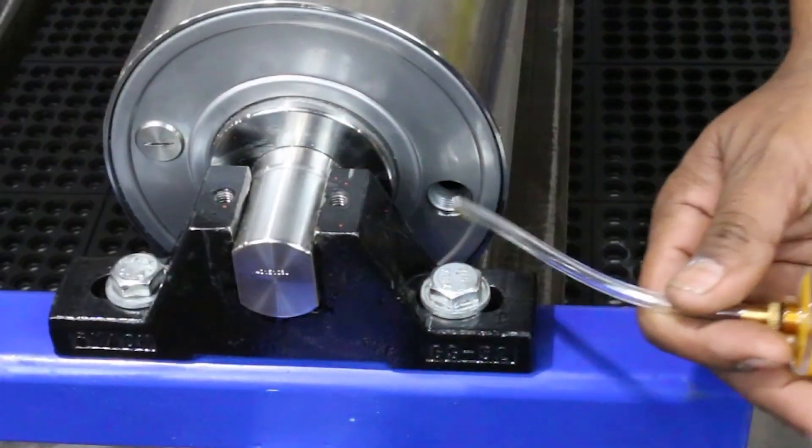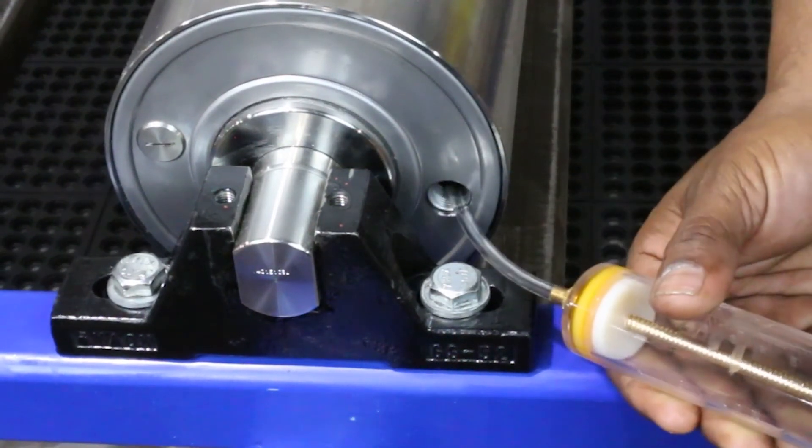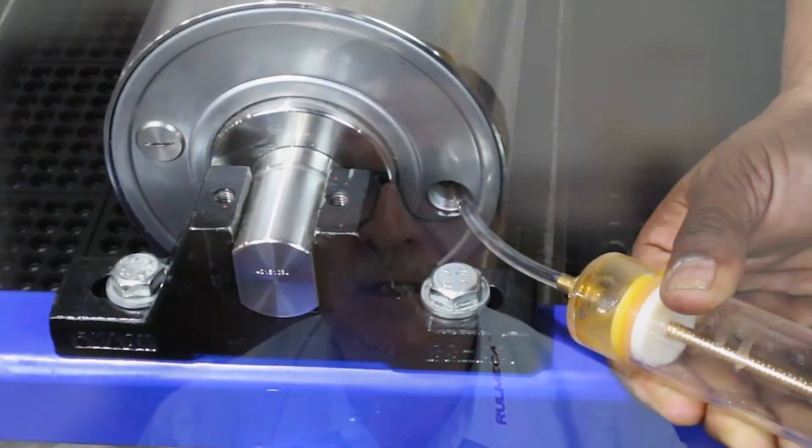To check the condition of the oil, remove an oil sample from the lower hole and examine its condition. The oil's cleanliness is always the best guideline regarding the wear and condition of gears and bearings, and whether to change the oil or delay the oil change. Note that the actual quantity of oil for a given pulley model and face width may vary with motor power and shell profile. Therefore, it's essential to determine the actual quantity of oil required prior to beginning the oil change.